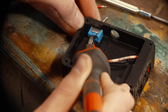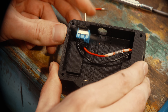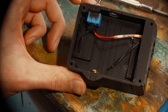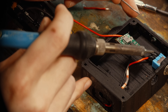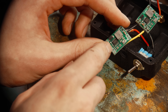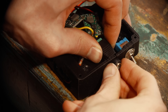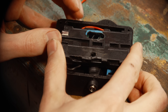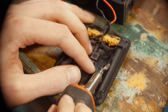I'm stupid — this is just a short circuit switch at this point. It's not supposed to connect the positive and negative; it runs through the positive. So this goes in as negative, this goes in as positive. This one will run 8 volts out to the monitor. Then we do another short run off the switched battery side to another step-down converter — that's going to run 3.8 volts for the wireless HDMI. That one can go into this power plug. Pack all that in, and this plate for the battery is going to slot in with a new printed cap, all fused together into one solid piece.